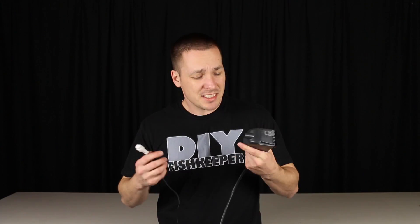First and foremost, I want to address a common mistake. A lot of people think that they can simply cut into the pump's wire and wire the float switch to it, which technically can work, but it's really dangerous. I want you to understand that under no circumstances do I recommend doing that. A float switch by itself is simply not going to be able to handle the current the pump puts through it, and you'll also ruin the pump or whatever equipment you connect it to. In this project, I'm going to show you how to build this safely, without requiring you to cut the pump wire.